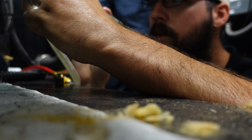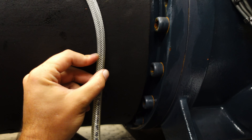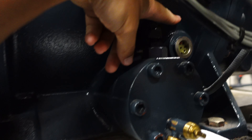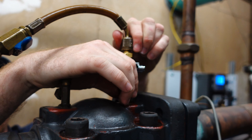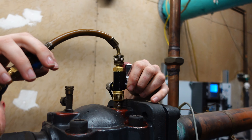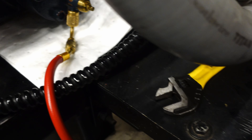If you need to check oil level on any system, you can use a procedure like this. On a lot of air-cooled systems, you'll go from the bottom of the oil separator or the compressor up to a discharge service port to equalize that way. In this particular one, we needed to use the suction side. We did try hooking up to the discharge side and realized the check valve was creating a pressure differential — we ended up just pushing from the high side back into the oil, creating flow without being able to check level. So we rerouted it over to the suction side instead.